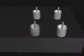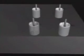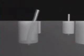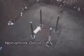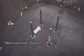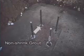The best way to allow for possible bending of the rebar is to create extra free length. This is especially important for larger sizes such as the popular number 11. An easy way to expose extra bar length is to use PVC pipe or corrugated plastic sleeves. After the bars are moved into position, the tubes are filled with a pre-blended non-shrink grout with compressive strength at least as high as the concrete around it.